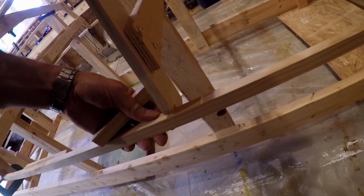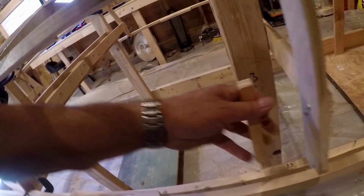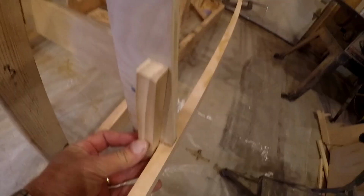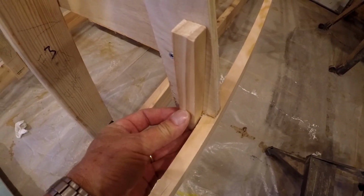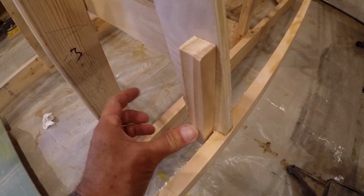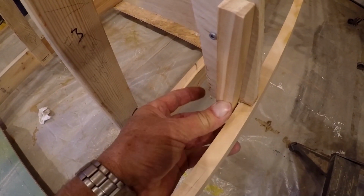The shear's wanting to move, so like I did on the other side, I'm going to install a backing block, and this needs to be something that once the plywood is across the side here is removable. So we want to have a screw going through that into the shear, holding it in place. So.